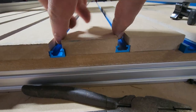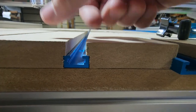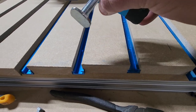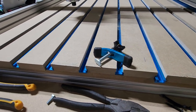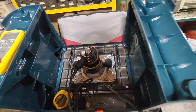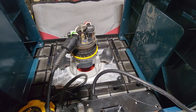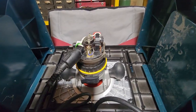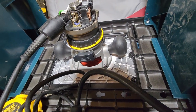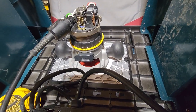I was doing these little cutouts on a router table so the T-track fits in there better — it won't pull out as much. On a clamp it'll want to pull up, so that should keep it down more. And there's still room to get the stud in there. So I was using the router table to do that, and my router broke. I was pretty annoyed. This router's pretty old but it only has like a couple hours of use on it, although it's probably 17 years old or more. I think the variable speed deal went out on it, so now I've gotta go buy another one. I needed it maybe like another 20 minutes and I'd been done.